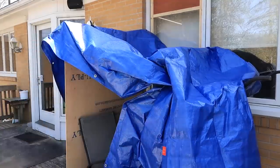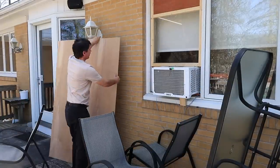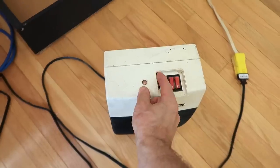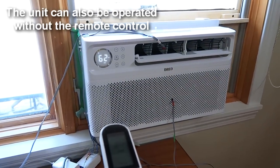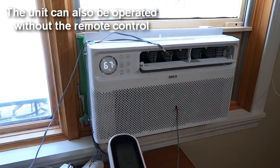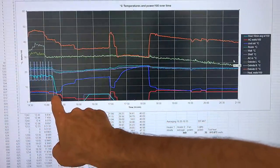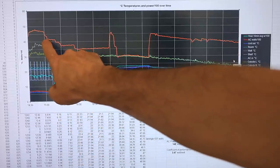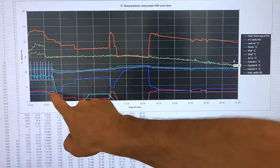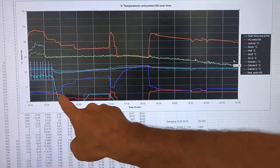That little fort around the AC made it hotter around the unit but didn't seem to diminish its cooling capacity at all, so I'm just taking it down now. For another test, I'll turn off the heaters and set this to 20 degrees, which is 68 Fahrenheit, and let it regulate to that temperature. With the heater off and the setting at 68 Fahrenheit, it gradually reduced its power in steps — the heat coming out the back also went down in steps, and the cool air got warmer in steps. So it's definitely stepping the power up and down in discrete steps.